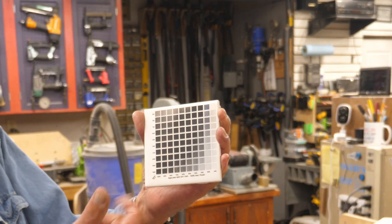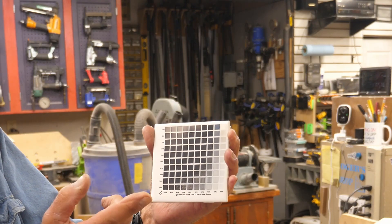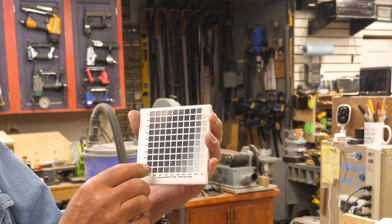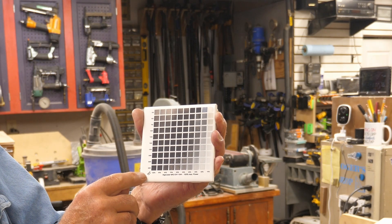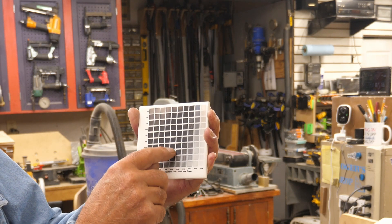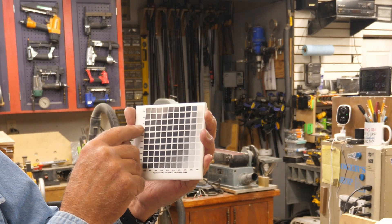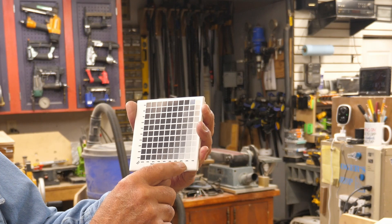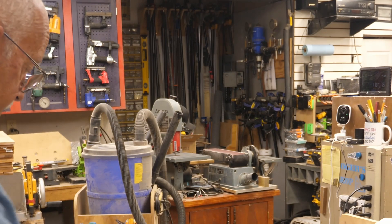Just another example - what do you do with these grids? This is for engraving, not for cutting. Power is across the bottom and your speed in millimeters per minute on the side. You want to find the best darkest color that's not just deeply engraved. For this particular laser, the Algo Laser MK2, to engrave ceramic tiles I want to go 1500 millimeters per minute at 60 percent power. If I wanted to go slower, say 750 millimeters per minute and still get that really dark color, I'd go at 30 percent power.